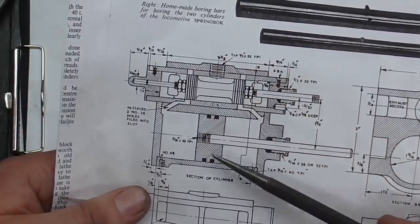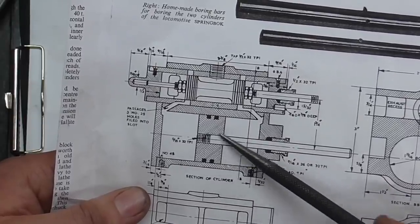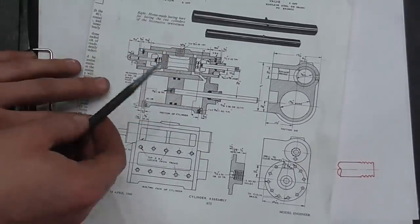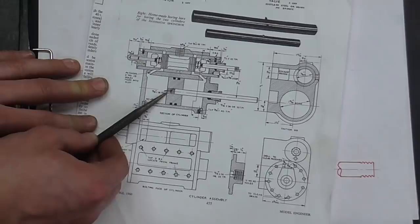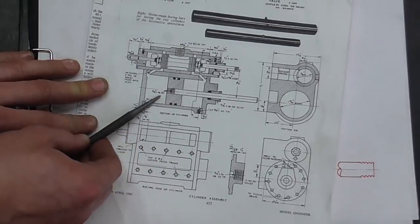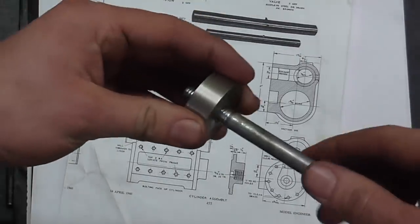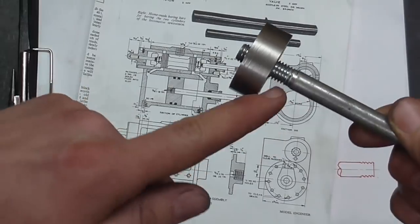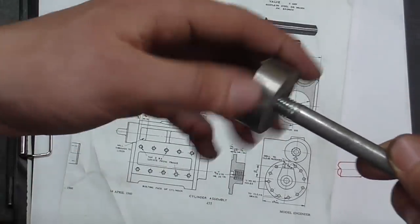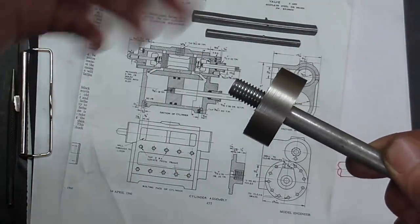The power piston however is fixed, and the first thing I'm going to look at is exactly how this is fixed. The plans for this locomotive actually suggest having a thread the same diameter as the rod and running the thread all the way through the piston. I found something in my scrap box to illustrate this — it's suggesting just a thread that runs to a shaft of a similar diameter, with a piston threaded all the way through that just winds on and eventually stops.